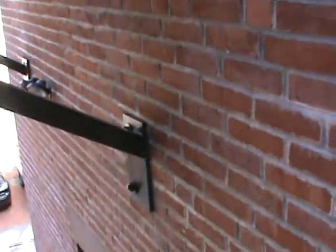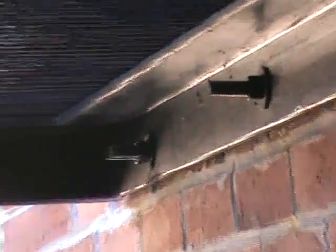We got 3/4 on that there, but look at that. Those are all half inch expansions. And you can't use expansion bolts. You're supposed to use Hilti bolts, 3/4 Hiltis back into the building. And all you need is one down at that end, a 3/4 Hilti, and one down at this end, a 3/4 Hilti, that makes it a part of this frame and part of this support. And that's what's happening up there.